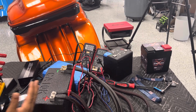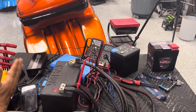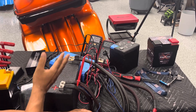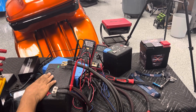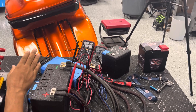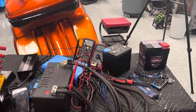You have to understand that what you're doing out there to destroy these amplifiers has to be really extreme. I'm testing the amplifier at half the impedance it should be tested at, but I made sure I'm running the proper size cables with proper fusing. The amplifier doesn't fail - the fuses fail because the amplifier is drawing more current than it's supposed to to create the 8,000 watts. If you wire everything properly with proper gauge wire and proper fusing, the amplifier should never fail. Wire it properly, treat it properly, tune it properly, don't clip it - this equipment performs amazing.